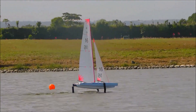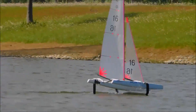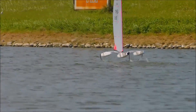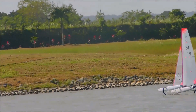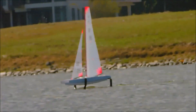One of the doubts I had when coming up with this new configuration for the boat was it might be susceptible to capsize over the lee bow when hit by a gust when moving slowly and the foils were not working effectively, relying on the comparatively narrow beam of the boat and the small volume of the floats. However, as you can see from this video, there are no signs of this happening whatsoever, which is good news.